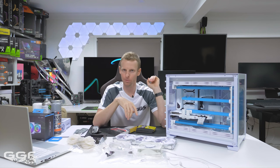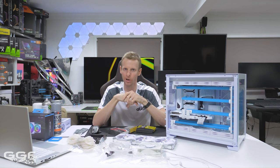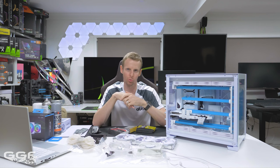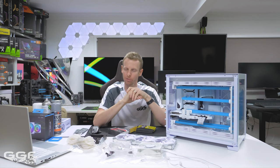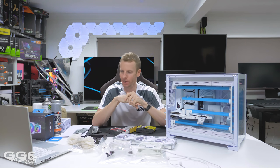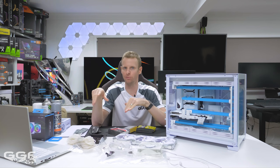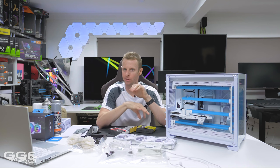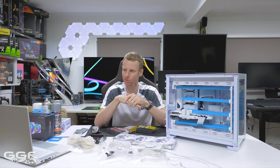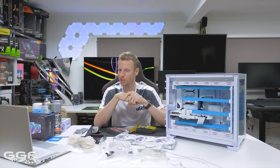The only thing that really nearly killed the system, I haven't got it in the charts. I normally test Aida64 FPU test. Now these 11th gen CPUs support AVX-512. I do believe that used to be in the server environment. When you run Aida64 FPU, it hits that AVX-512 if you have no offset. I didn't really want to tinker around and show you Aida64, and you guys can go back to some of my other videos where it isn't running AVX-512, so I just decided to leave it out. So the Aida64 AVX-512 ran the system at about 90-95 degrees.